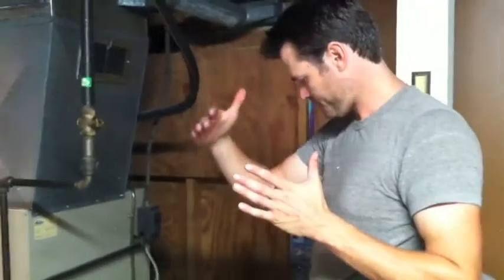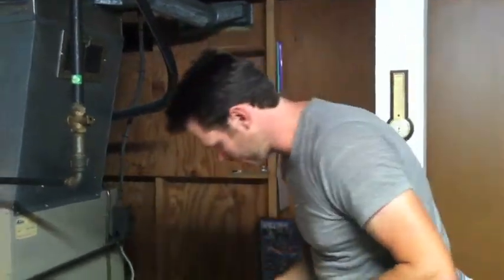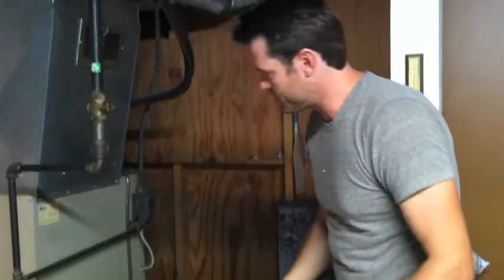And the CO on there, it shot up real fast, and it always does that on the high efficiency furnaces. As soon as you put the probe in, it shoots way up to 300 parts per million, and then starts coming back down, and now it's right around 6 or 7, which is about normal.